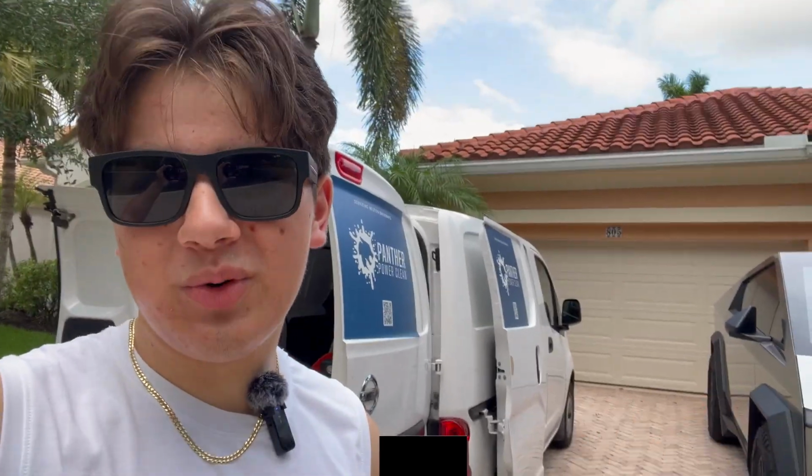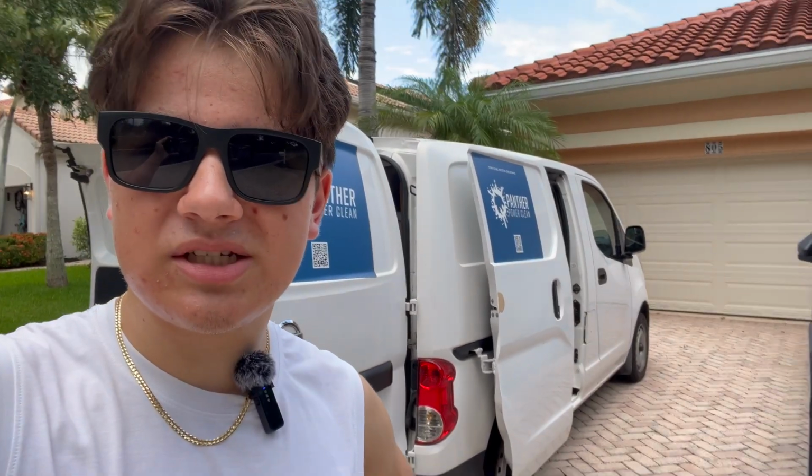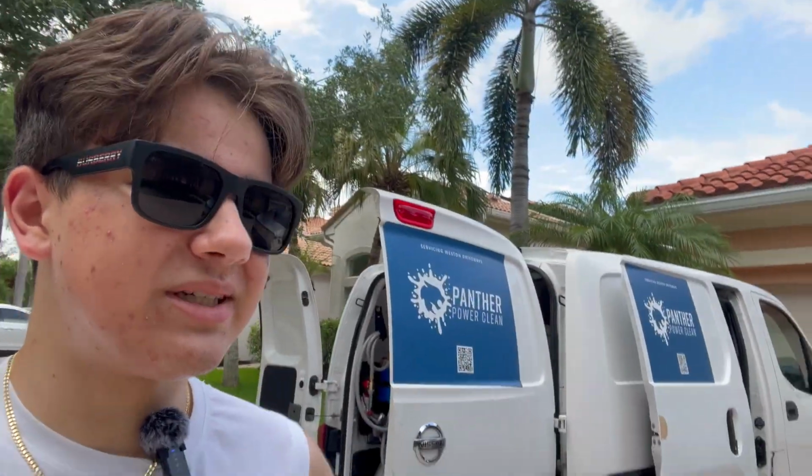If you have a 1 gallon per minute pressure washer and you buy like a 30-inch surface cleaner disc, you would assume that it would be really strong and it would just power through and you could run across the driveway and finish it in 5 seconds, but that is not how it works. Physics works a bit differently. The problem you run into is you're spreading out the water too thin. There's not enough water coming in, only 1 gallon per minute, and you're spreading it across 30 inches in diameter. You run into spreading your resources too thin, and so you don't get a good result.